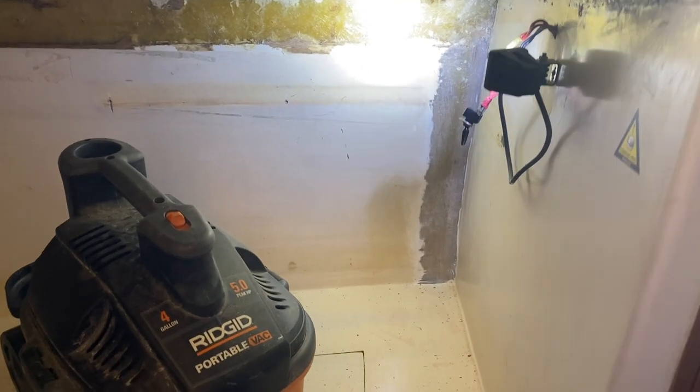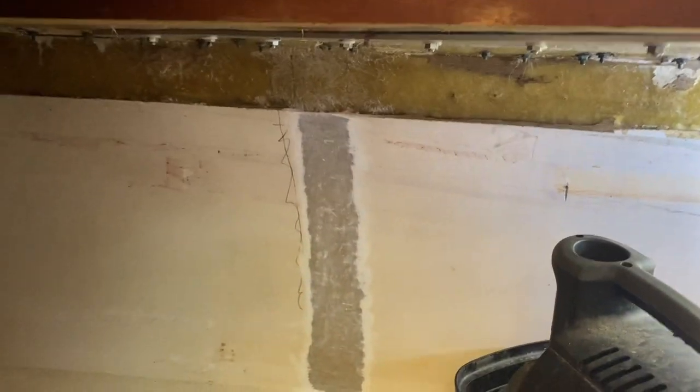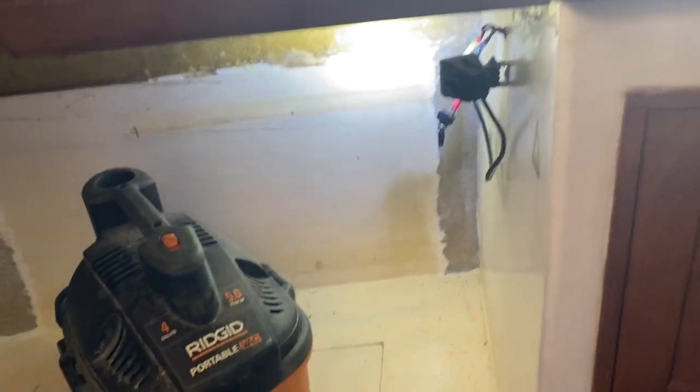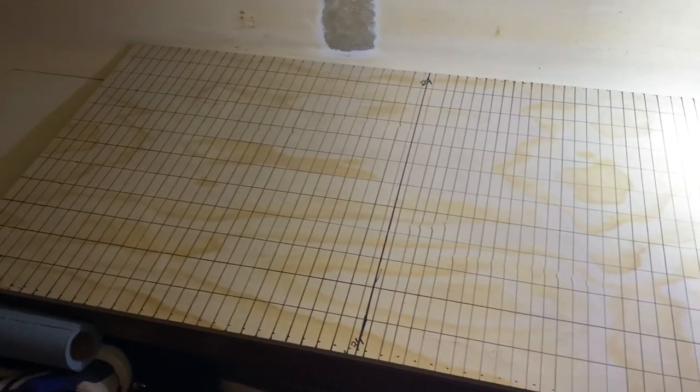All right, so got the first beam ground down, second beam ground down, and third and final beam ground down. And luckily, we're lucky on this spot, it's already on fiberglass. So I just gave it a quick sand, so epoxy is going to bond to that. So a little easier than our main cabin, which is nice. I'm covered in dust and pretty itchy right now, but you know, I'll survive. All right, so this is the plywood all marked up and ready for kerfing tomorrow.